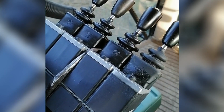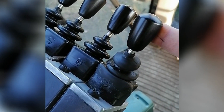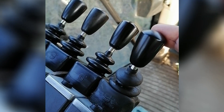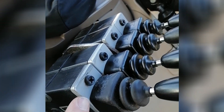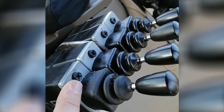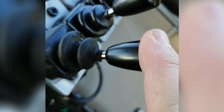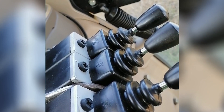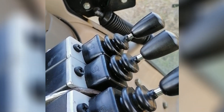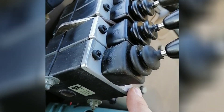The levers are individual blocks on two, three, four, and it's full electric. The more you pull it the quicker it goes, and if things go too quick you adjust this Phillips head screw on the top side and you can either speed it up or slow it down. The screw on the bottom controls speed in the other direction. Each individual one you can have at your own set speed, so if you need to lift it quickly but drop it slowly, you can adjust everything on these and it's a simple system that works really well.